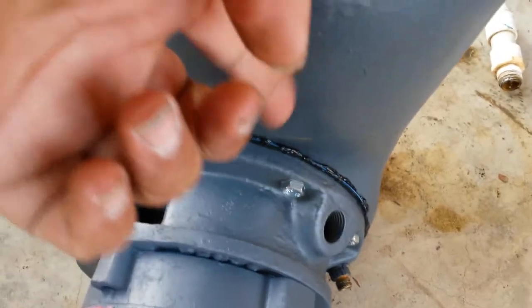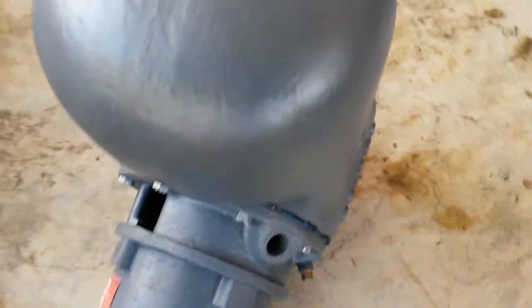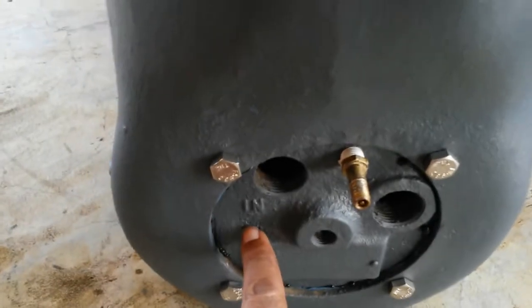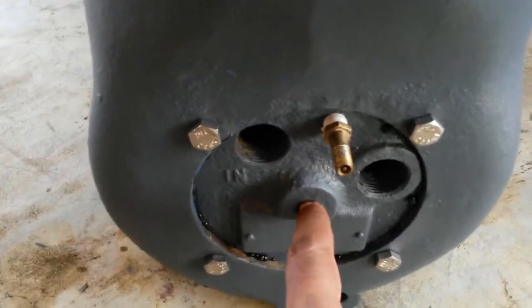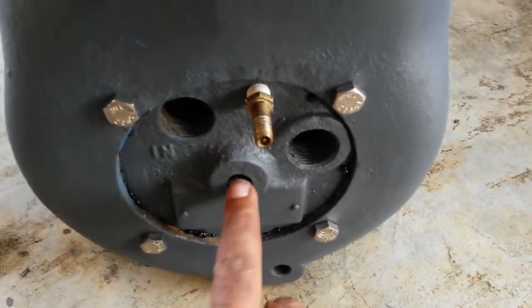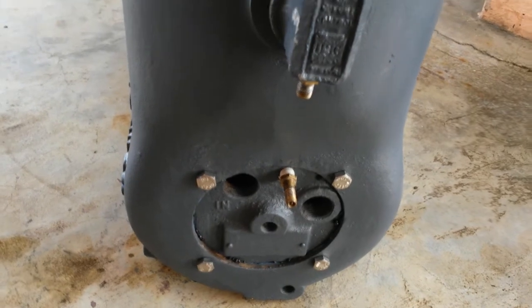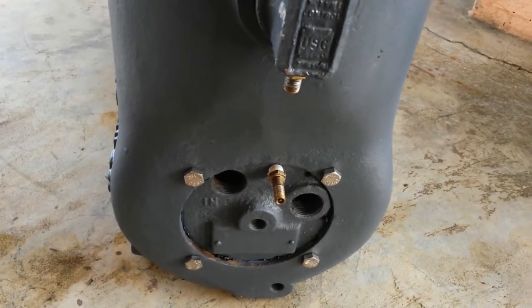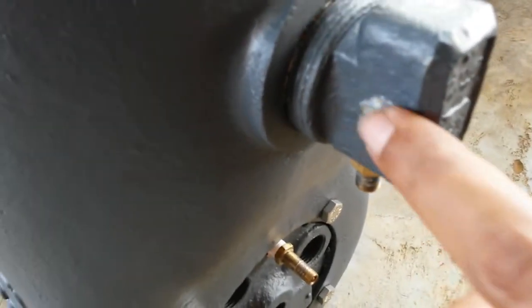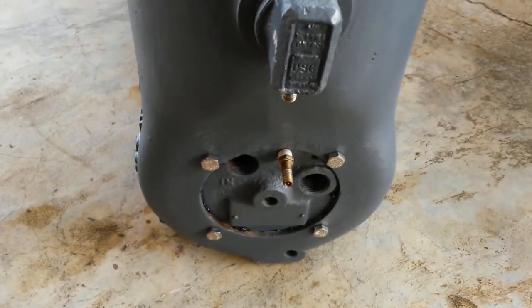So time to put in the pressure valve. This is the priming plug, so that is only when I'm ready to basically prime the pump. I'll put that in after I finish priming. And then we have the inlet and outlet ports, so obviously those are the things. The plug for cleaning the jet and the drain plug. Both of these are severely corroded, especially this one. What I'm going to have to do is weld and regrind and make back the hex, because I cannot find those screws. I had a couple of little scrapes hunting around and trying to put this on the side while I was tightening up. But apart from that, yeah, looks decent enough. Hopefully it doesn't leak and it works.